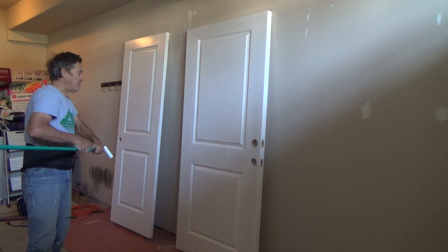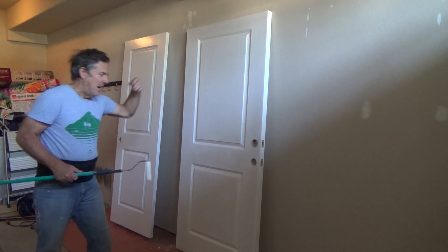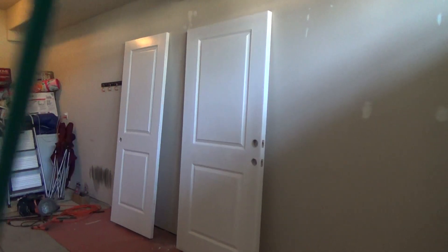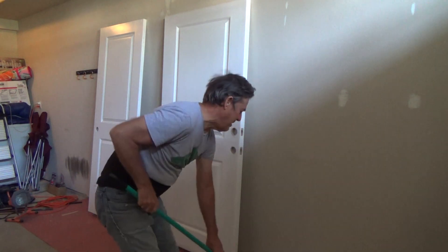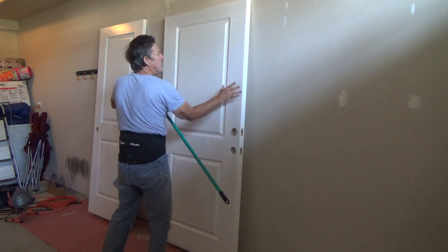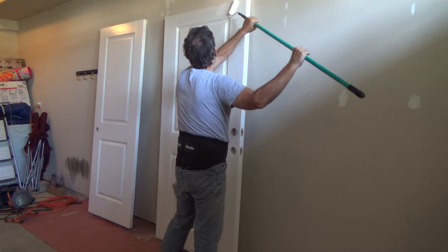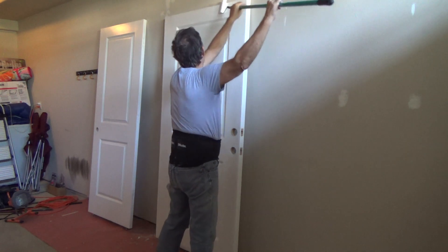That's why I don't do the edges before I do the first coat on one side of the door. I do the front edge first, let it dry, flip the door around, then I can do the edges. Now I can get right into my paint and start painting the face of the door. The stiles go straight up and down — these bits of wood are dado'd in there — so I'll do those first.